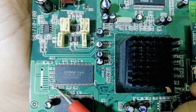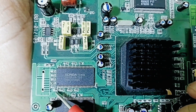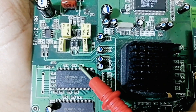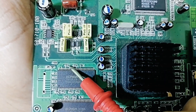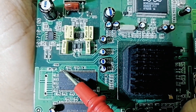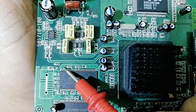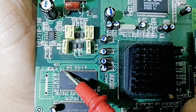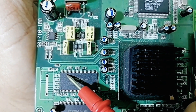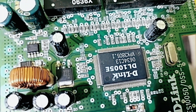This bolded line is connected to the ceramic capacitor — so this is the input power, and here we have the ground. The ground is connected to the IC at several pins. If I put one probe of the multimeter here and another probe at ground, I will get a buzzer — a continuity. This is how I can determine whether a pin is connected to ground, a power rail, or is just an enable signal. If you understand this trick, you can analyze any circuit or IC.